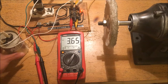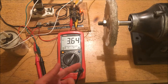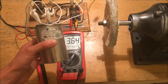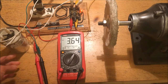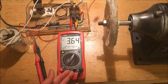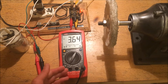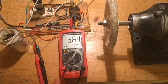Just as the motor has a large inductance and a large lagging current — a current that lags behind voltage — this capacitor has a great deal of leading current. The current through this capacitor leads the voltage. As a result, it draws a lot of current but doesn't dissipate any real power at all. This is the difference between real power and reactive power. I'm going to get out the oscilloscope next so we can do some more measurements and power line analysis on these loads to give you a better idea of what's going on.